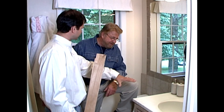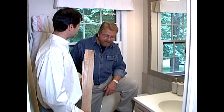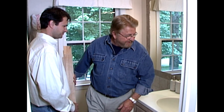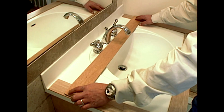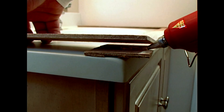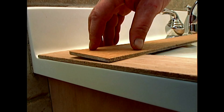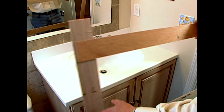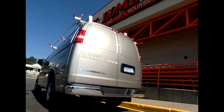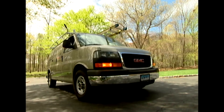Great, well I'm sold. What do you got here? These are strips of wood — what I'll do with these is make a template of your existing countertop, then we'll make our counter from that. Jeff lays strips of quarter-inch plywood along the edges of the existing countertop, then attaches them together using hot-melt glue. When he's finished he's got a template that will allow him to duplicate the exact size and shape. Then Jeff and I make a trip to the home improvement center to pick up the materials we'll need for the new countertop.